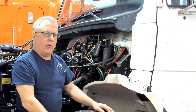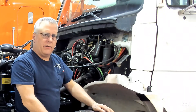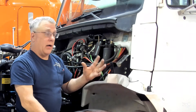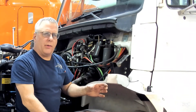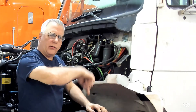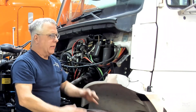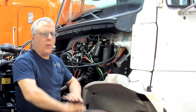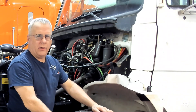If you have an evaporator that's gone bad with oil that leaked in there, the blower motor — sometimes three or four screws and you can take it out. Resistor blocks on some of the older ones, you can take those out and go in through the opening, which gets you really close to your evaporator core. That's how we can test things in the dash and check for leaks within the dash without tearing the entire dash apart to get to the evaporator core.